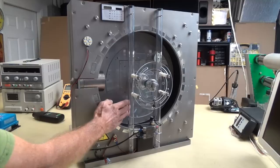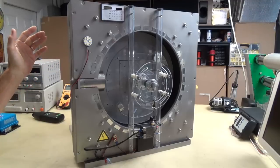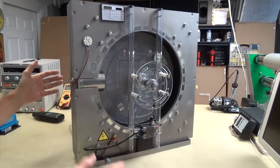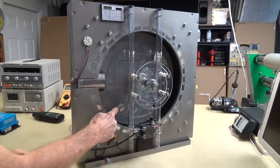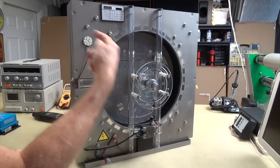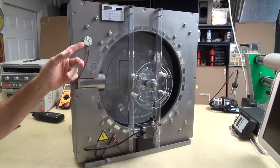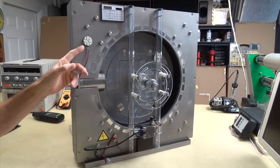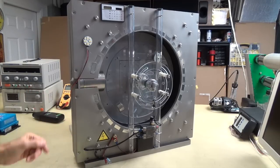It's going slow right now because of that flywheel weight, but I've also got a really beautiful three-phase alternator that's also attached to that. So right now, the whole mass weight that this one magnet is responsible to power is about 25 pounds. And it's not just 25 pounds of balanced weight. It is balanced, of course, but there's a three-phase alternator and you can put that under load. I wouldn't call this much of a load. It's 12 volts, but I could run 20 of these or maybe more from that three-phase alternator.